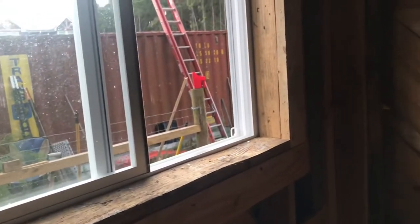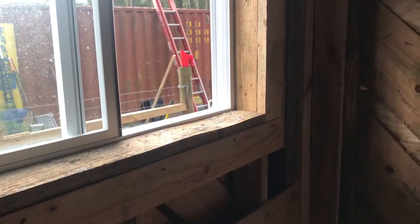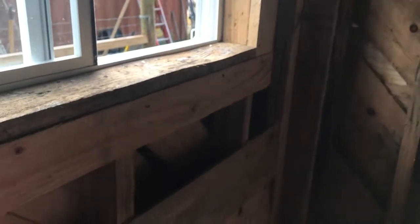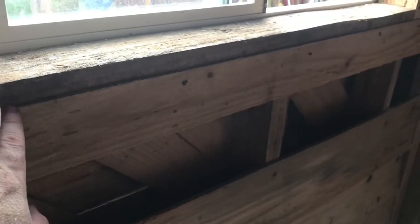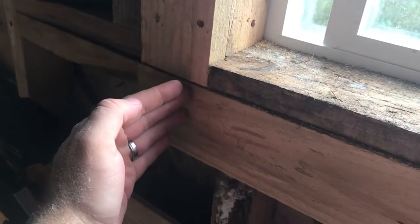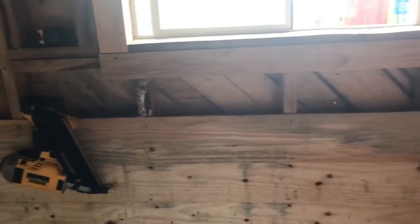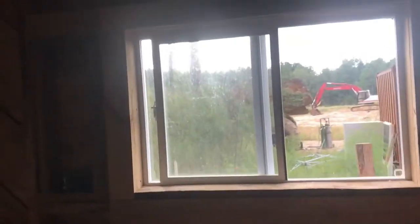She had mentioned building a box that's two and a half inches all the way around the inside and then putting a face frame on - which would make sense for squaring and shimming it true. I built this one in place because nothing about this little shed is square, so I knew trying to build it on the floor and stand it up probably wouldn't go well. I actually like the way I did it better because I gained that extra inch. With her method the sill would have been the same size but you'd have seen a seam right on the window sill - I didn't want that, I wanted this board to protect it. I had nailed the window sill in first, not really thinking, so I notched it back out for the board to come down beside it.